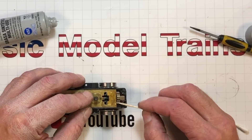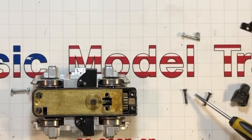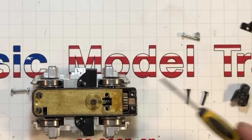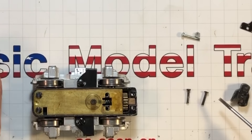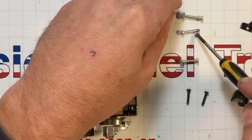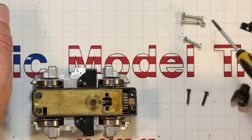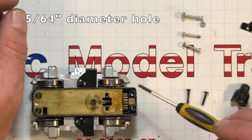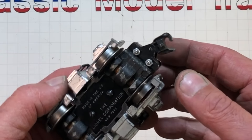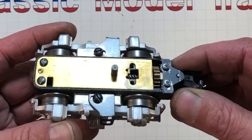Got this brass plate and a couple screws up front — get some grease on this gear while I can. I went into town today searching for some of these rivets and there's nothing local. There might be some Lionel parts guys out there who have them, but I never think of that kind of stuff when I'm working and the production schedule never allows it. I had to find something local. These are number four screws — too big — but the specialty bolt shop in town found some metrics that fit in the hole. I think this is going to work.